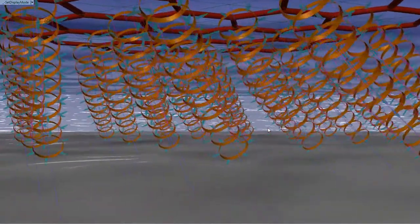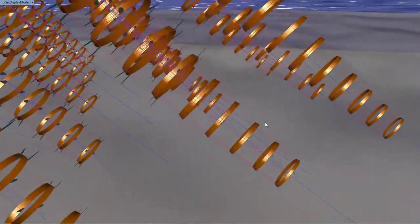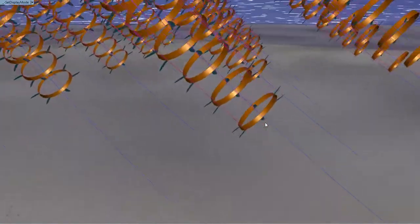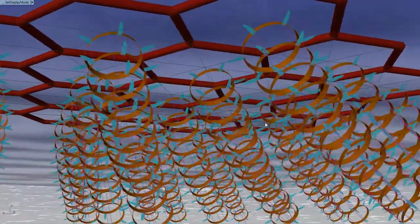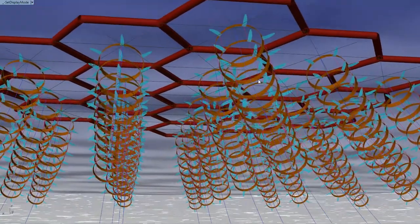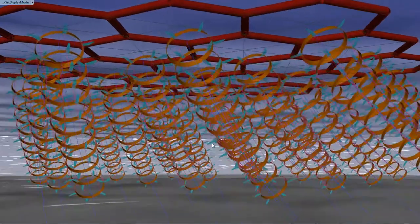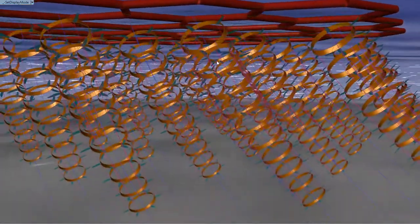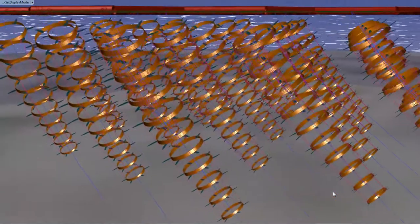You've got these rings. The rings are slightly coned, so it's a bit like chopped windsocks turned back to front. And on each ring, on each bit of cone, you've got a blade, sharp and fast at the top, because you want that speed. It's in a bit faster flow at the top, right, enough to match the speed at the bottom, so the rotation's similar. However, you'll get torque transferred all the way up. If the bottom is faster, that's great.